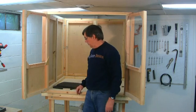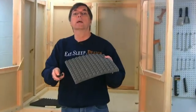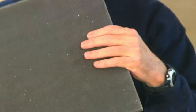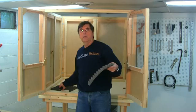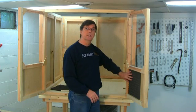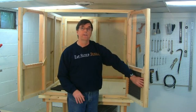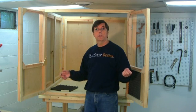I'm going to install this sound deadening foam. This is a special sound deadening foam I found online — it's one inch thick and looks like little pyramids. I'll take this and glue it into the inside of the enclosure, specifically into the recessed areas in the doors and the sides. I'll use spray contact cement and cut them down to size — these panels are 12 inches, so I'll cut the 12 by 18 pieces in half to fill the void. This should make it much quieter in the machine, hopefully.